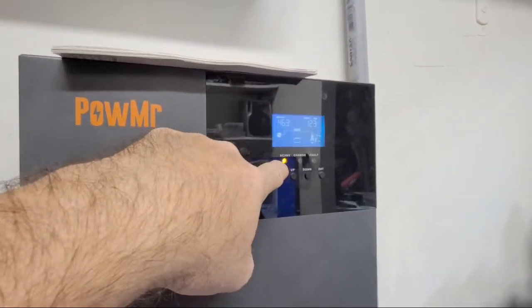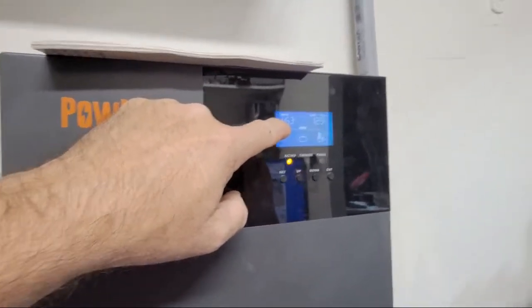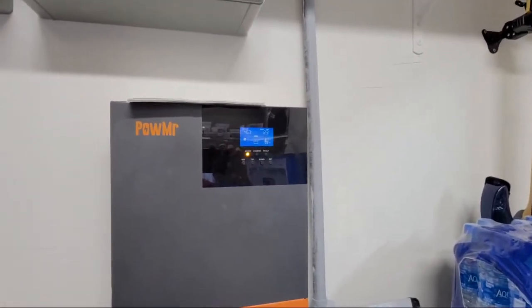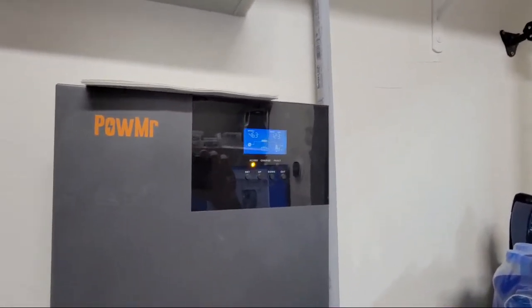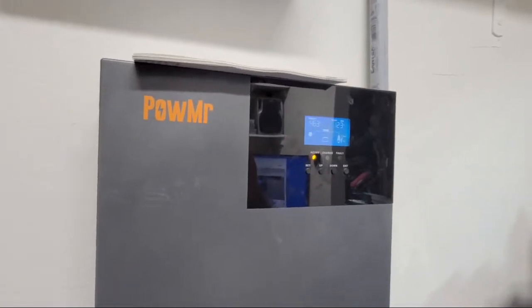So it's already, see, it's not on solar. I did set it to where it doesn't drain the batteries down as much because I want to save some battery too. So right now we're not using all those lithium batteries. It's not topping it off. It's not even hardly getting it up to 50 volts by the time, I don't have any good sun this time of year. And then we're only taking it down to like 46-point-something, and then I have it switching over. So it is using solar power when it can make it, but mostly this thing's been running on utility right now at this point,